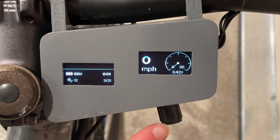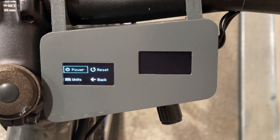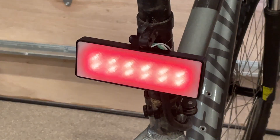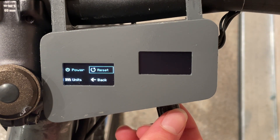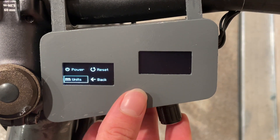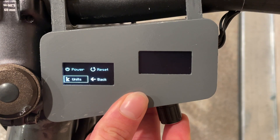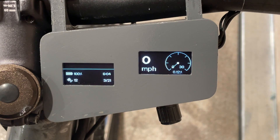If you shift your attention to the bottom right, you'll notice a knob. By pressing it inwards, it brings up a menu. The first option is for riding at night if the battery is low, as it turns on the front and back lights and inhibits everything else. The second option is more for debugging, as it soft resets the Arduino. The third option allows you to choose between miles per hour and kilometers per hour, and remembers your selection even after a restart. And finally, you can go back to the main screen with a cool animation and the press of the last menu button.